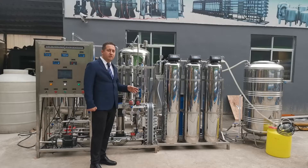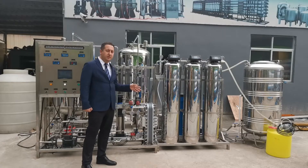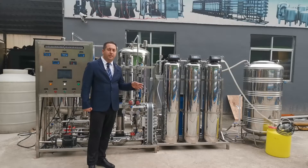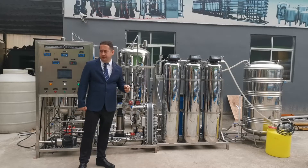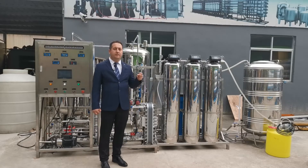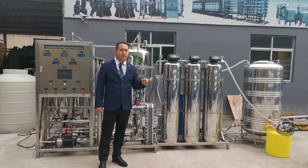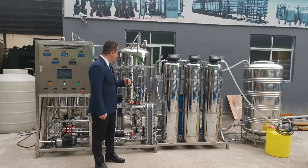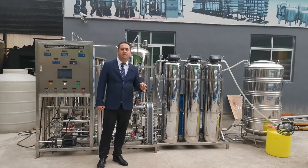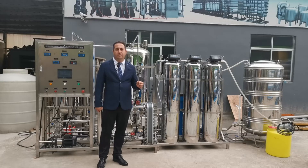Then in our project we are using a high pressure pump, Grundfos. The Grundfos pump sends our water to the membranes. In this project we have three membranes. In the first pass, the water passes through two membranes. After this, the clean water goes again with another high pressure pump to the third membrane. In this project we use the DOW 4040 LCLE Filmtec membrane.